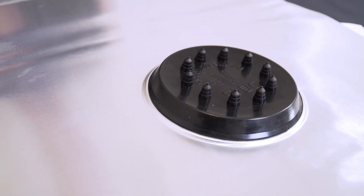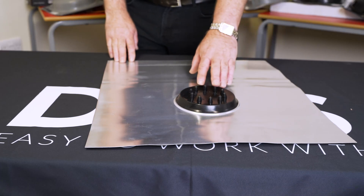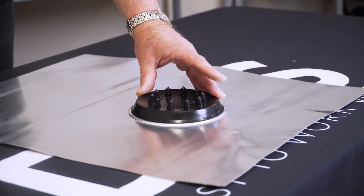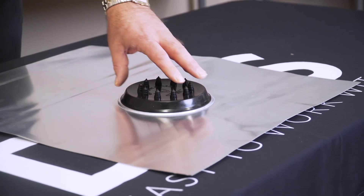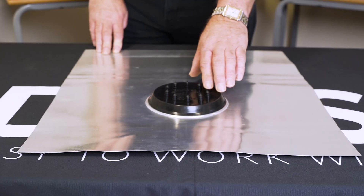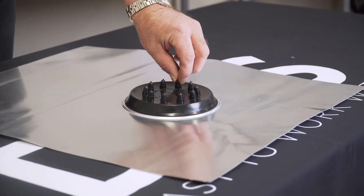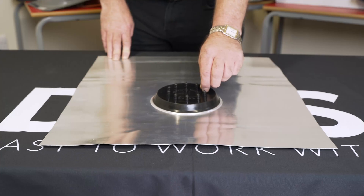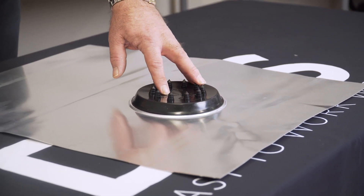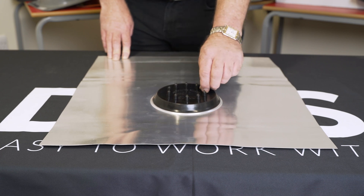This is a SolarDeck multi-cable aluminium, specifically for use on solar PV. It has an EPDM cable seal bonded to an aluminium flashing material. It has 10 cable penetration points for cables between four and eight millimetres. There's a diagram on the flashing which tells you where to cut on what rib for the cable specified.